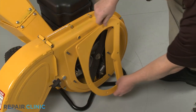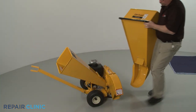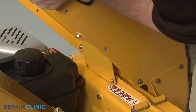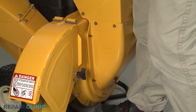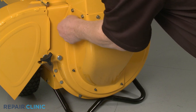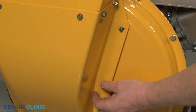Realign the shredder plate on the six impeller housing bolts. Re-install the hopper assembly by aligning the support plate on the two upper mounting bolts first, then rotate the assembly to align it on the impeller housing bolts. Thread and tighten all eight mounting nuts to secure. We recommend hand-threading the nuts first, then using the socket to tighten once all the nuts are in place. The chipper shredder should now be ready for use.